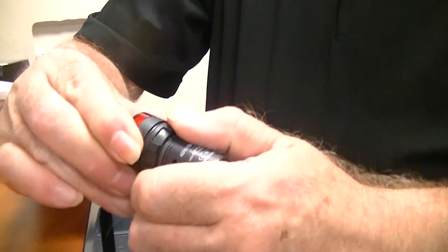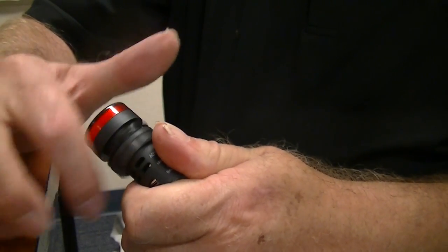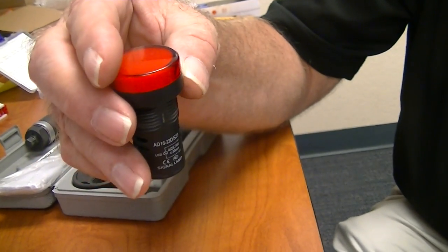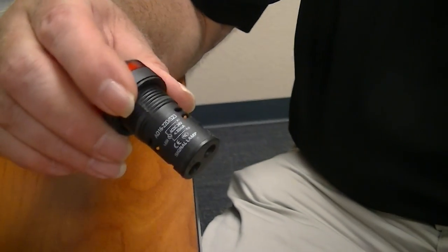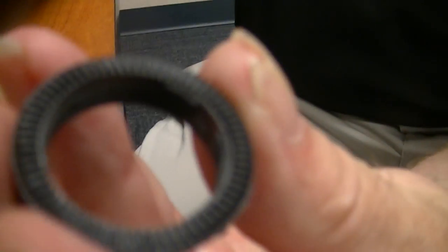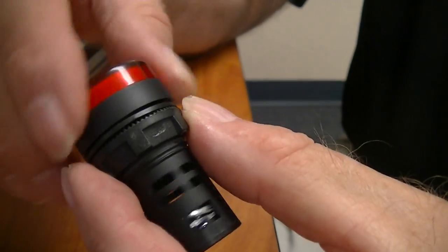Here's a pilot light — same way it mounts. You push it through the opening; this part sticks on the outside and it's gasketed. You want that gasket on the outside surface because that's where any contamination would come from. Stick it through, put the rough surface against the box, tighten it down, and it's securely mounted.